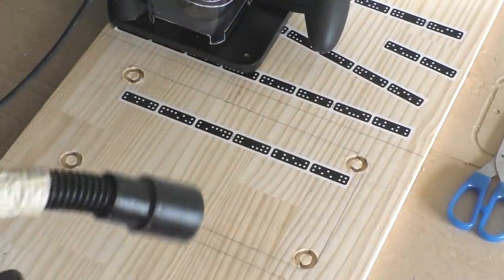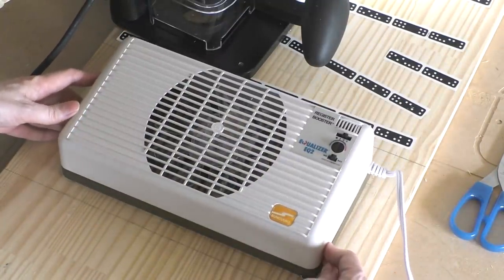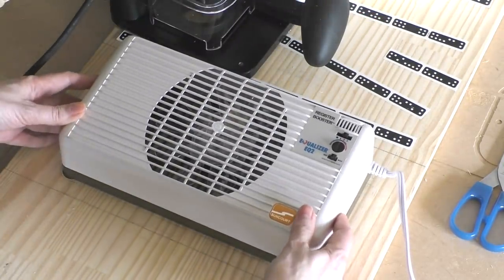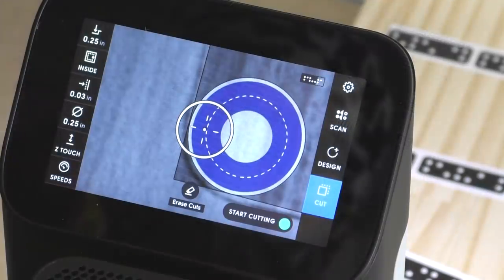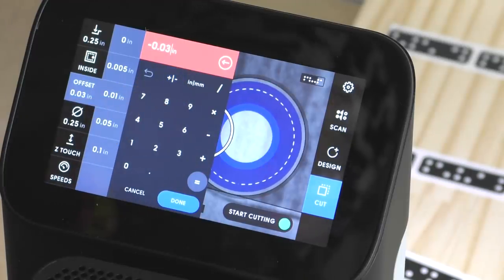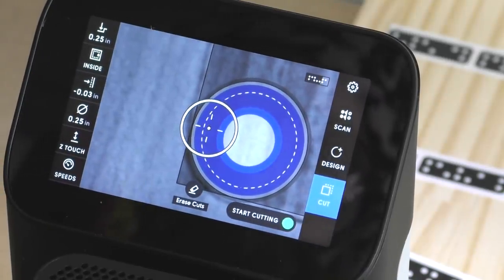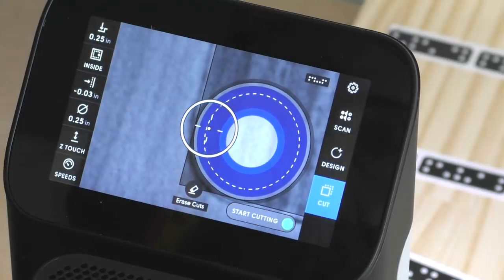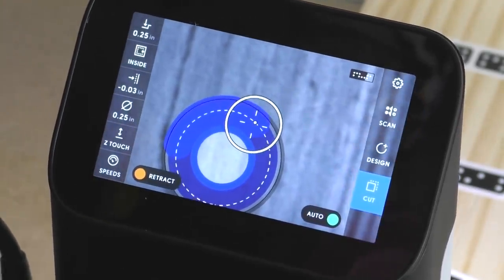Vacuuming up the debris, I do a quick check of the corners against the fan. I can see that I'm gonna have to go a little over—another 30 thou isn't going to cut it, so I need to go 60 total. I change the positive offset to negative and go negative 30 thou, which on an interior cut actually goes 30 thou outside the line—cutting away another 60 thousandths of an inch of material. Same quarter-inch depth, but this second pass takes another 60 thou off the outside of each of those circles.